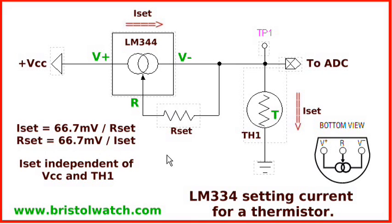If you saw my earlier video, I was using the LM334 to control the bias on a PNP transistor in order to control its collector current and power up a high-powered LED. The LM334 is a low-power device, limited to 10 milliamps, which is why driving high-powered LEDs required a driver transistor. Here, we're going to use it in its basic series pass constant current source mode to control the current through a resistive sensor.